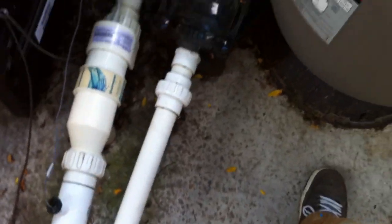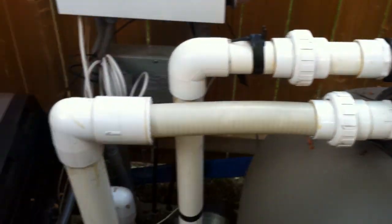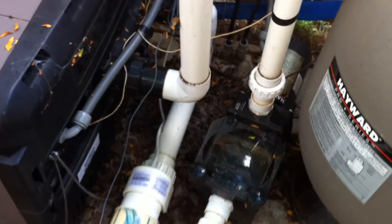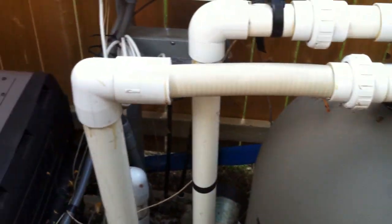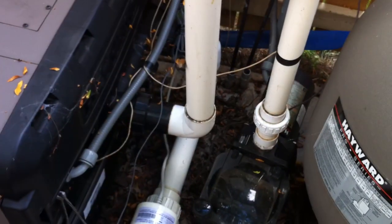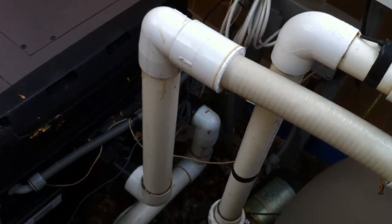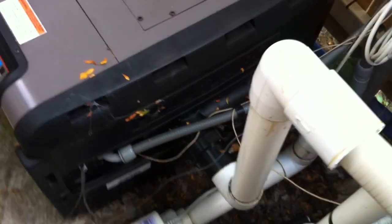It's worth mentioning that this entire system is plumbed in inch-and-a-half except for this section right here. I'm guessing the installer didn't have any more inch-and-a-half when they installed that — that's probably why that section is two inch. There would be no reason to have two inch just there. Either you'd have the whole pad in two inch or essentially nothing; there's no point in having just one small section be two inch and the rest inch-and-a-half.